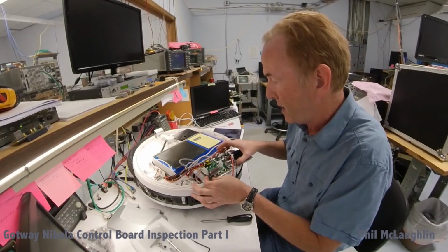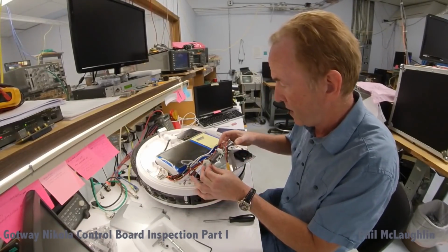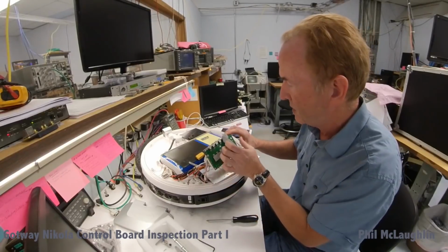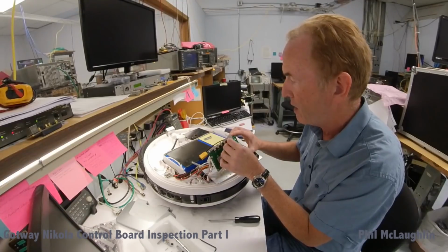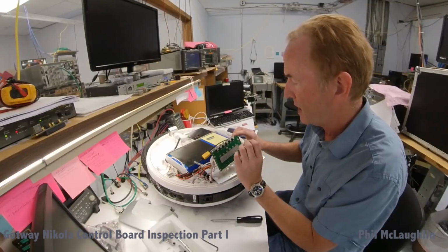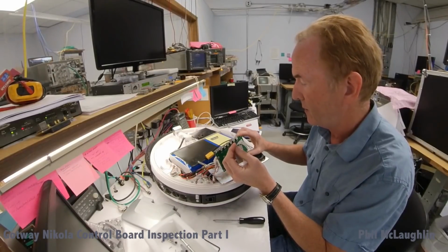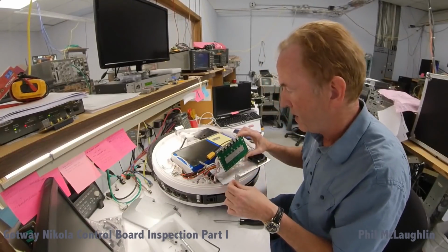So here we go, and I'll get a better camera angle once we see. But this should be the big reveal right here. Okay. So what we see, which is what we had seen previously, is the top row of MOSFETs, the ones on the edge, had the barrier on them but were not attached by any type of material. So this looks like a good connection, in so much as the capability of this thermal barrier is able to deliver. This looks like a pretty good job.